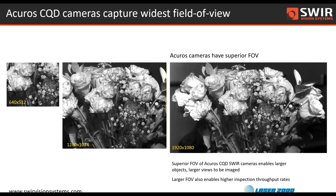Now we can dive into some of my favorite parts, which is the imaging. This is a nice slide that asks: what is the advantage that having more pixels brings to an imaging application? Simply put, for a given working distance from an object, more pixels gives you more field of view — you can clearly see more of the object. Flip that around if you want to trade field of view for magnification: you can also get a lot more pixels in a smaller area with a more powerful lens. So higher resolution or wider field of view — both can be enabled by having more pixels.